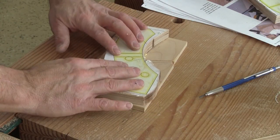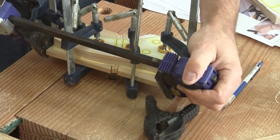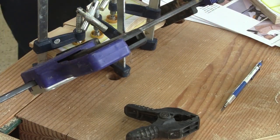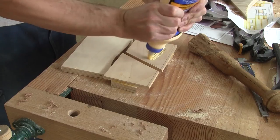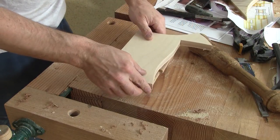These will become the carriage bolt holes. To be sure they're parallel to each other, I put a scrap piece of plywood between both pieces and clamp all three pieces together. I do the same thing for the other ones and let the glue dry. When it's dry, I glue the last pieces on the back and put that aside.